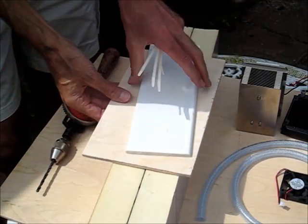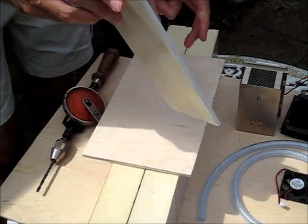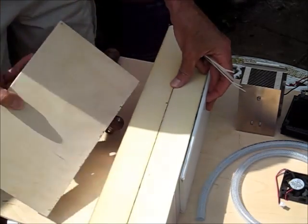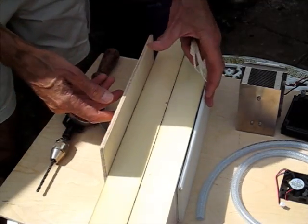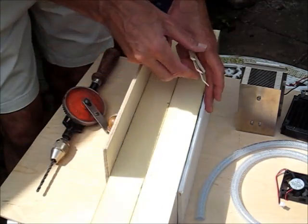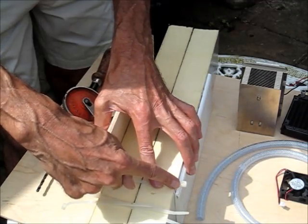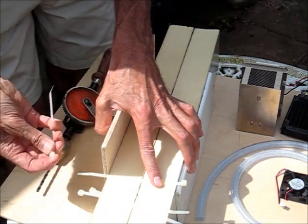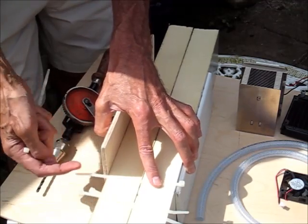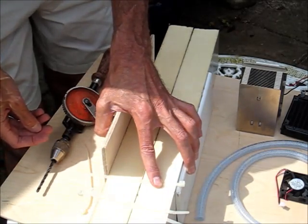So some more components here. I've cut a piece of window board — PVC coated — that's going to be used on the inside of the box to mount the components. I've also cut a piece of thin exterior ply; these are just scrap materials I had lying around, just to demonstrate how they're going to be fitted. This will be the side of the box. I'm going to drill four holes, one in each corner, and then I'm going to use cable ties in a fairly unconventional way — feeding them through the hole on one side and out the hole on the other side, then putting the head of the cable tie on and pulling it as tight as possible with pliers. That way I'll have a firm mounting on each side and avoid using a metal thermal bridge between the hot and cold sides.